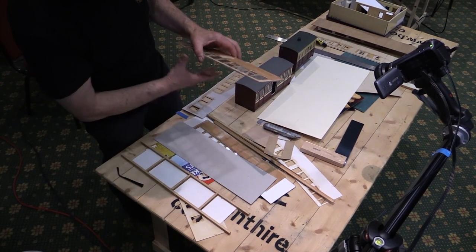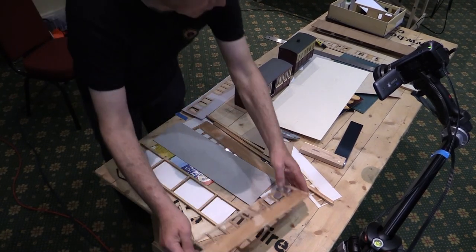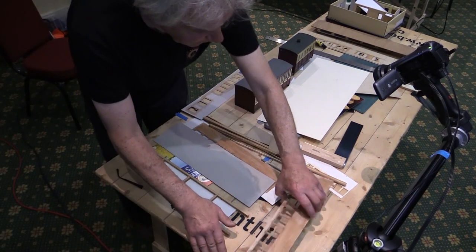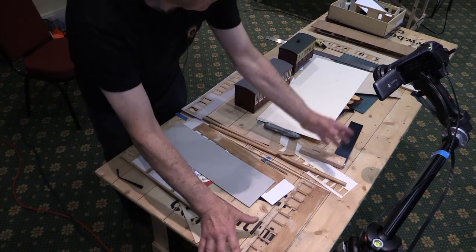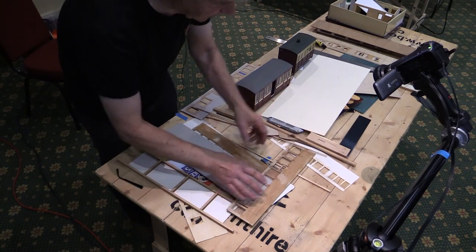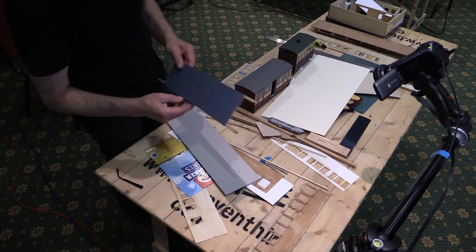You may want to just put a piece of plastic, cellophane or the plastic bag or something underneath. You need a flat surface, something like a piece of chipboard. Obviously, you don't want to glue your lamination actually to the flat surface. Maybe if you feel there's too much glue around, we can just use a piece of plastic bag just to prevent anything adhering where it shouldn't. And we leave that to settle, to stick.